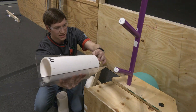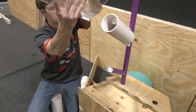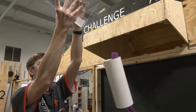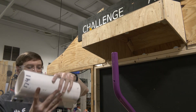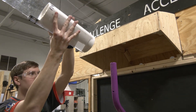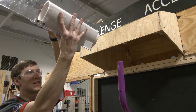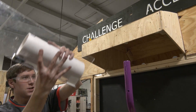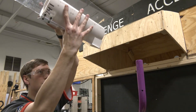You can see with some distance — I can even back it up — that coral sliding out of the robot is going to be able to score on L2, L3, and L4. One thing that a lot of teams are wondering is what kind of angles you can get away with for this L4 coral. Even some shallow angles, if you put force behind them — this would need to be an active mechanism. That one fell off, but we have seen some consistency in launching the coral at shallower angles.